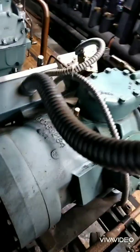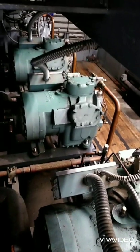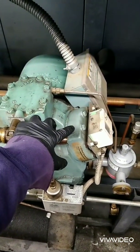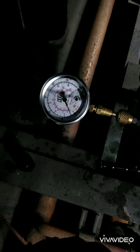Without compressor 1 unloading — running and unloading — compressor 2 just kicks on in short cycles. I've had them check the program out. Really, there should be an unloader on this head. If I had more time, I'd love to put an unloader and wire it to the contacts up here. I believe we can do it on channel 8 — it's open on this board — and add another stage.